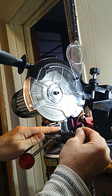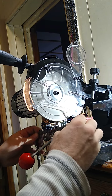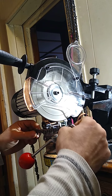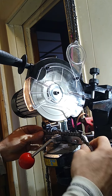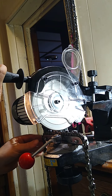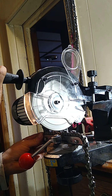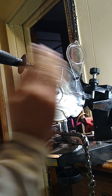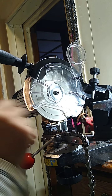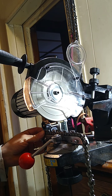For each raker, make sure you don't hit your cutting edge. For the other side of the chain, take your chain off and flip it around. You always do the side of the chain furthest from you — this one you do in reverse. This way it's pushing the chain the same direction both ways, so there's no angle — it's all the same. Real nice.